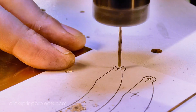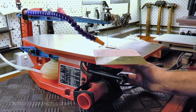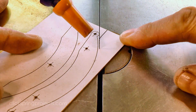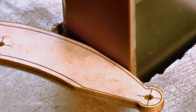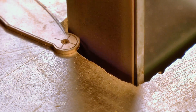I'm using a printed template stuck on the brass sheet to position the holes, and then from here I can rough out the shape using the scroll saw. The belt sander brings the cut closer to the line, leaving a small amount on the part for final finishing with needle files.